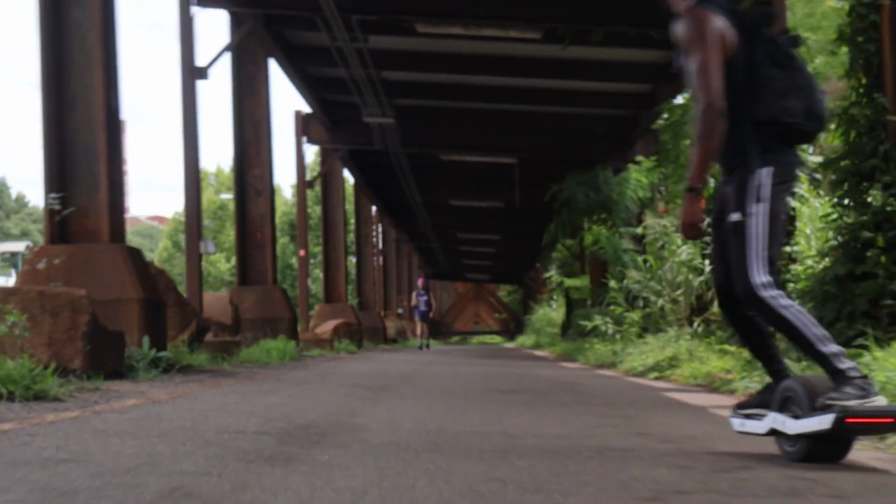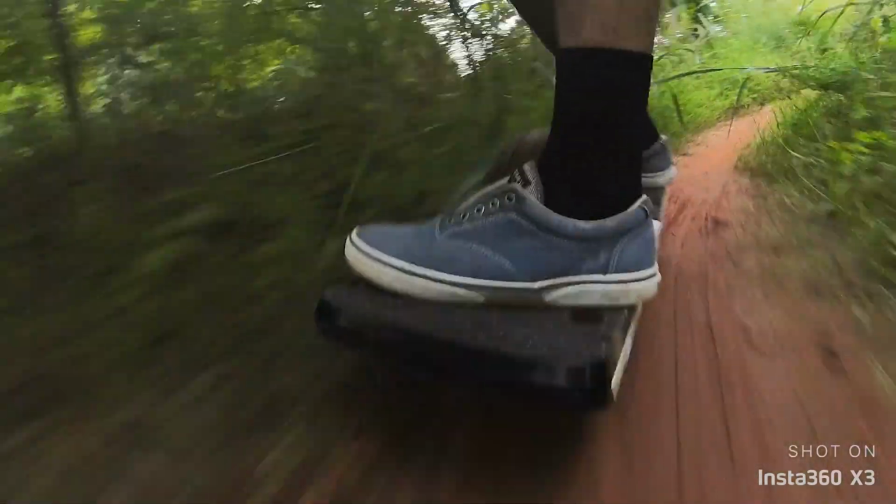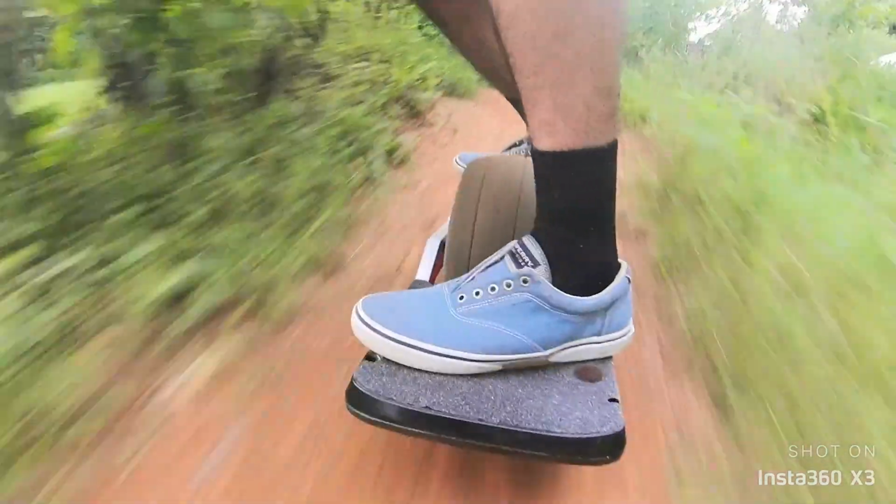My favorite option on these rails are the lower and raising options. If I want more of a floating city XR ride feel, I'll drop it down to the lower setting. But if I'm seeking a ride that I'm going on trails and I want the most clearance possible and I'm okay with a higher center of gravity, like a GT feel, I'll raise it to the higher one. These rails are super versatile.